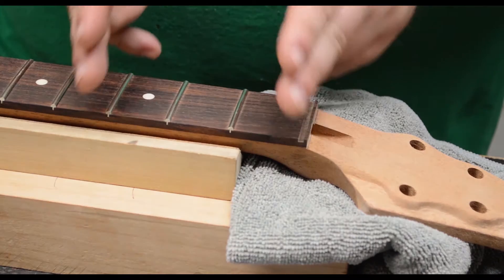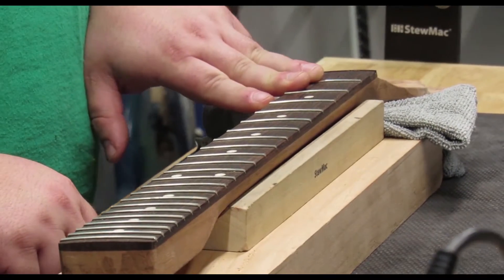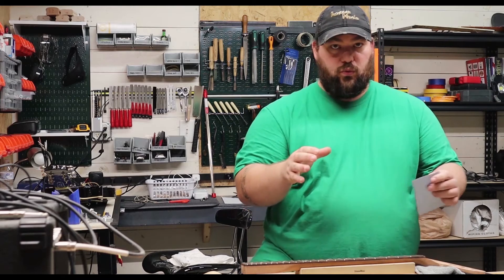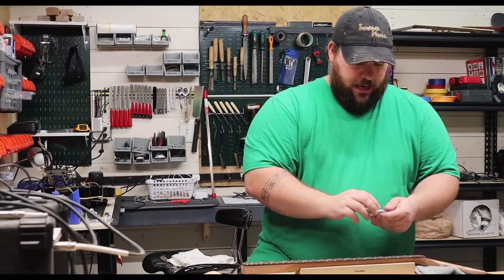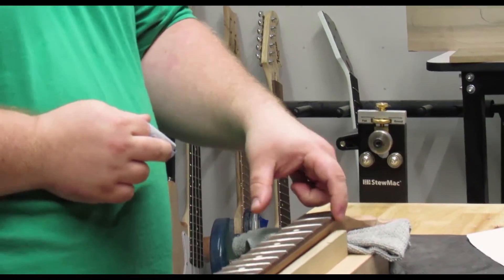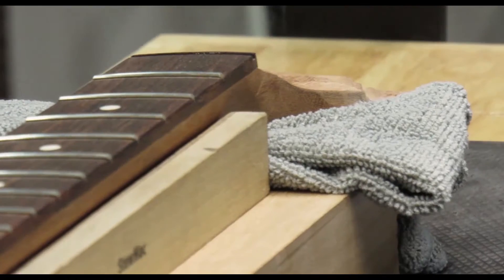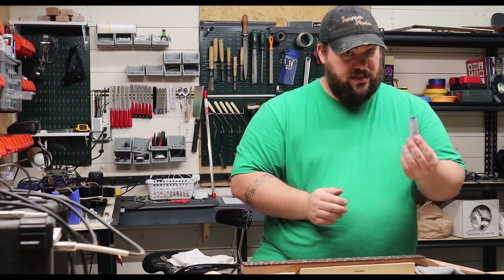Today we're going to focus on the first three frets of this fretboard for the fret end work, but what I'm about to do in this first step I'm going to apply to the entire length of the fretboard so I don't have to redo it later. So I've got my 220 sandpaper — there is no single correct way to do this. I love using sandpaper as a tool and I tend to wrap it on my fingers. We have a nice clean cut on our frets with a nice angle, but if you were to feel that, it doesn't feel great. We want it to feel like it's been played even though it's brand new. So we're going to roll these edges with the sandpaper. We don't need to lacquer the sides of the fretboard — this is all rosewood, we're just going to oil it — so sanding it is not a big deal.